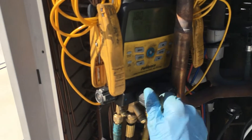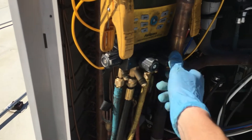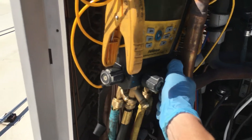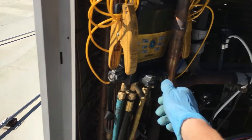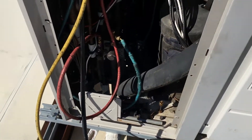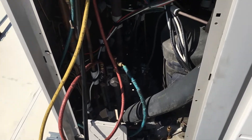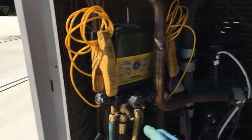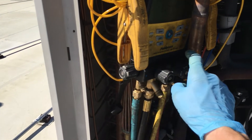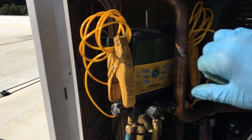We'll kill off the big vacuum line. We'll kill off the little refrigerant charging line. And now it'll balance out. And you see it actually dropped. Because there's a harmonics, an oscillation, a resonance of pulsations, and it messes with your true readings. That's why when you isolate it off, your readings can go up or your readings could go down.